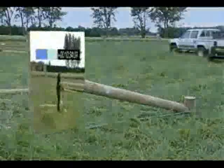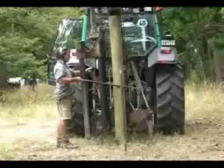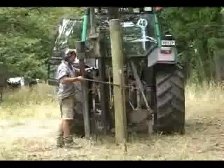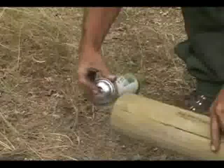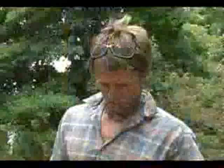Meanwhile, our conventional end post is more or less here. The ViceBite stay bracket is ideal for use with an H-brace or boxed end assembly using a horizontal stay. Once the end post and backing post have been installed, measure and trim the horizontal stay to a neat fit between the two posts. A ViceBite bracket is then secured to the end post — for a neater job, adjust the support ledge to a 90 degree angle, ready for the horizontal stay.